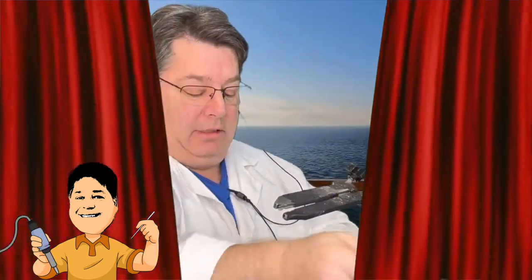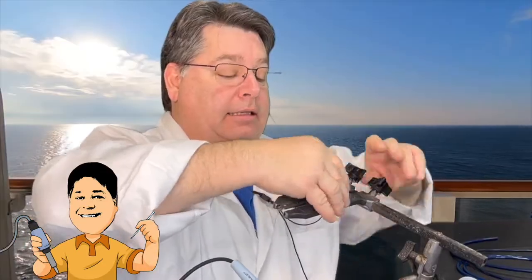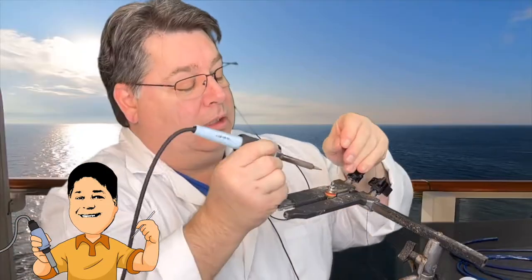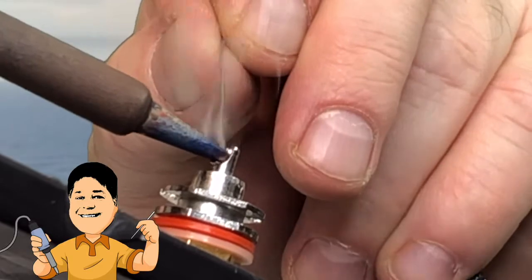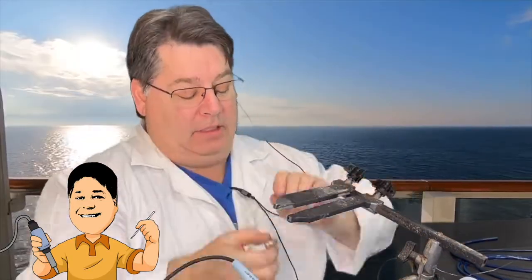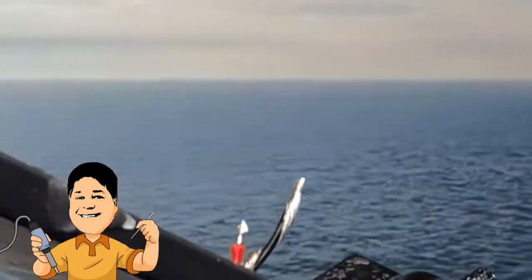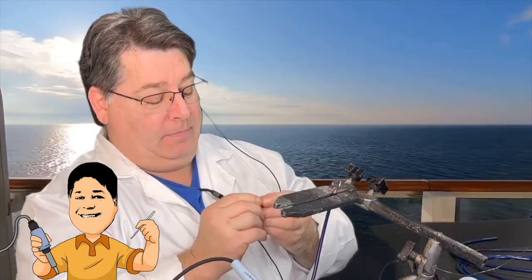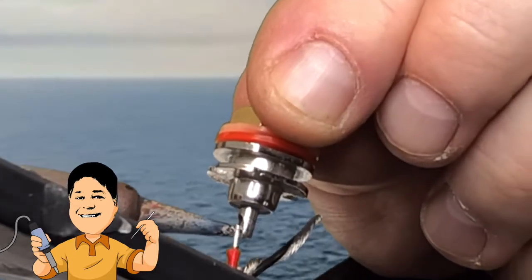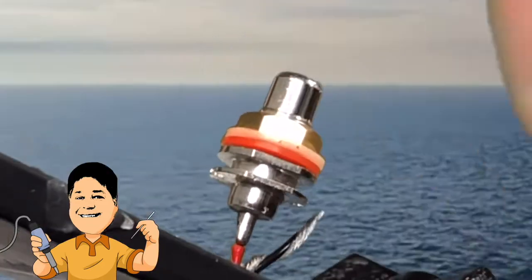And now I present Jesus Ornelas, who's soldering on board a cruise ship in the Pacific Ocean for some reason. You can see the little solder cup there — it's just upside down. I'm gonna put a little pre-solder in there, just a little bit. Just like that. Tape it out, put the wire back in. Put it on the right side for the positive, and then hold it up against there and put your tip right at the end. Done.